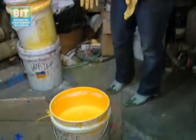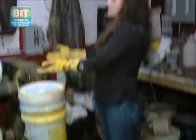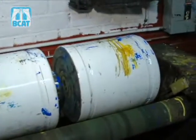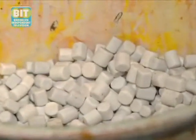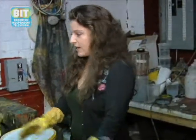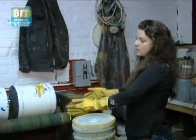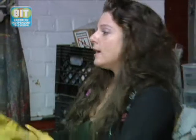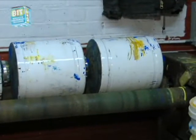This raw pigment concentrate, which needs to be ground, goes into ceramic jars — this is actually the old-fashioned way of grinding pigment. Industrial companies now use steel blades that spin around, but it doesn't do as good a job as these ceramic jars with little ceramic balls inside. A five-gallon batch goes into three jars, so we've got twelve jars here, putting four colors on at a time. All pigments grind for different amounts of time, between 24 and 48 hours. They're extremely heavy — unbelievably hard labor — but we believe in the old-fashioned way because you get a better, very fine grind.